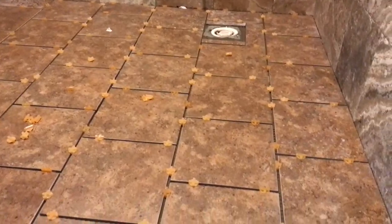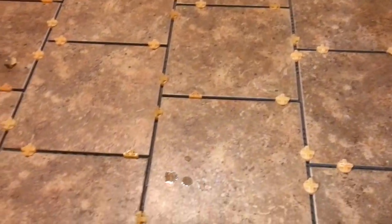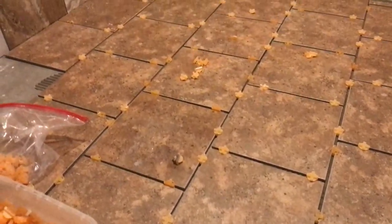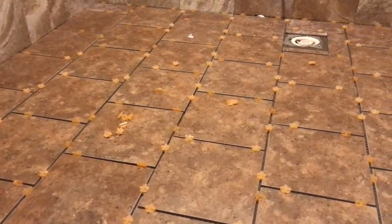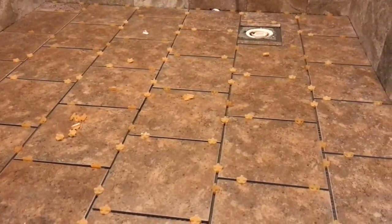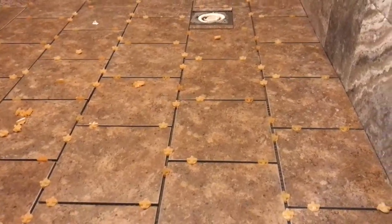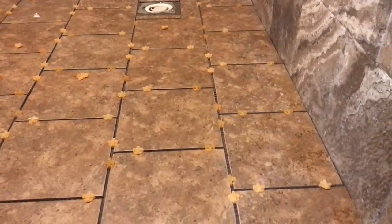We have completed our flooring in our bath project. You'll notice we've used 1/4-inch grout spacers, which does keep them fairly close to being accurate. But again, you need to cheat occasionally because of the out of squareness of a tile. We did have to use a little extra mud in some locations to get things fairly level.